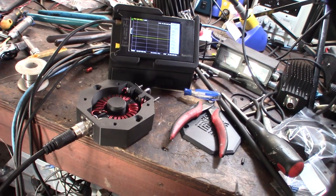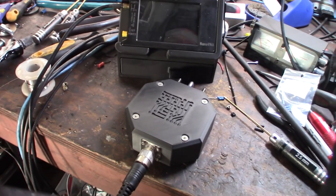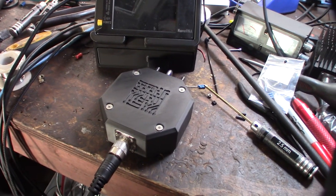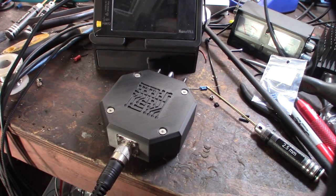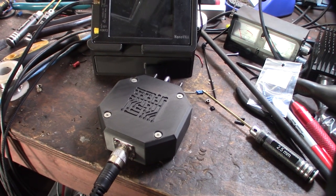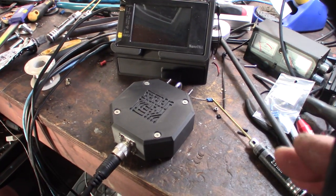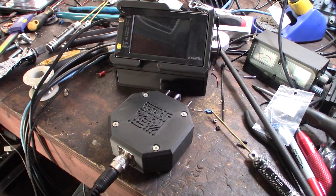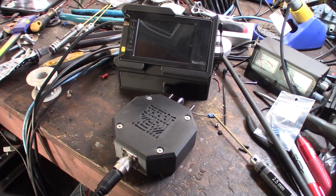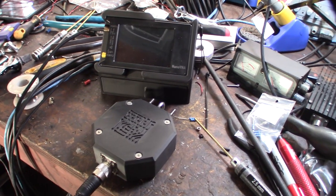Tomorrow I'll put leads on it and do more testing. I might make a separate video for the full dipole build — that'll take longer since I'll need to do antenna length testing. This video was just about making the 1:1 balun. I'll put the call sign of the inventor in the description. Let me know — if I want to tune this for 27 MHz CB, should I add or remove turns on the toroid, or do I need a different toroid material to bring resonance up into the 10- and 11-meter band?